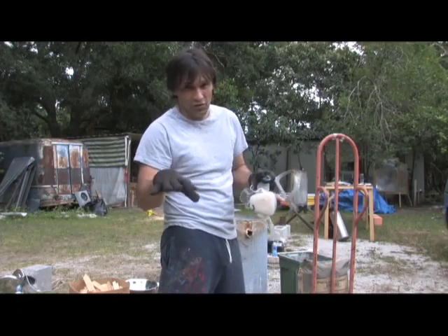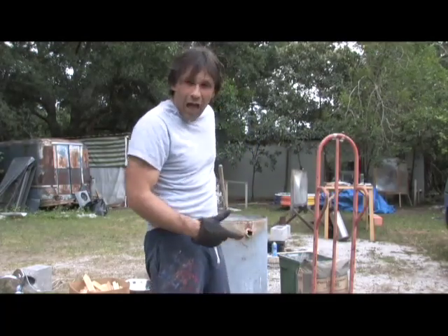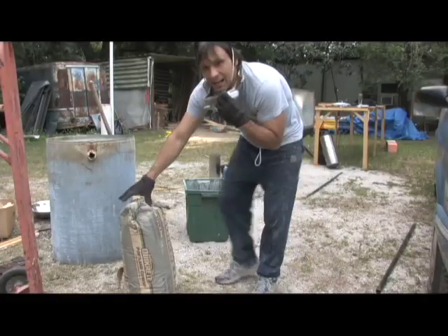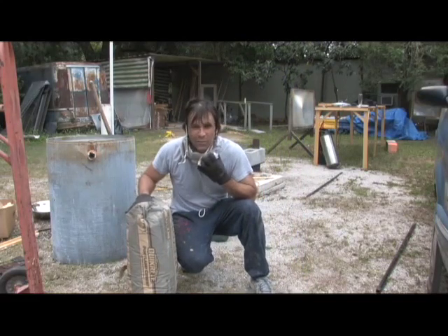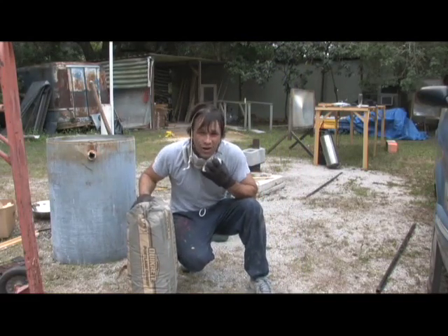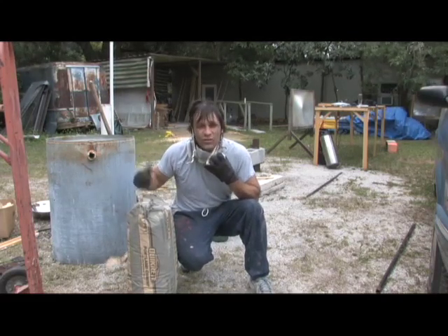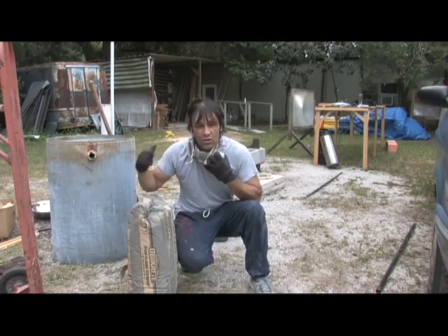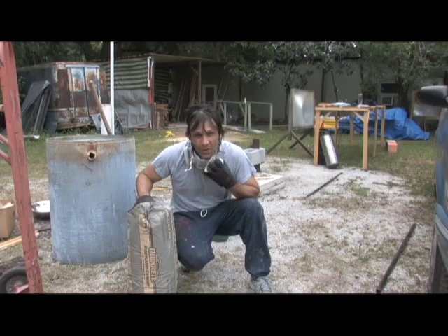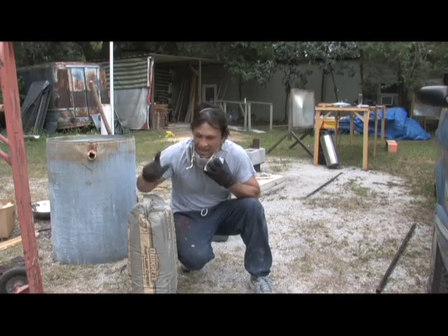I'll have pictures to prove it in future videos, but for now we're just going to be mixing this by hand because we don't need a whole lot for this. We're going to be filling this up, basically making a mold. This is a 94-pound bag of Portland cement — the QuickRite brand. You can use pre-mix if you want, but it takes a lot longer to harden. This stuff, you can mix it one-to-one and get a really strong concrete. We're using recycled crushed concrete from a recycling place close to us — basically broken up concrete pieces — so it mixes fantastic with this.